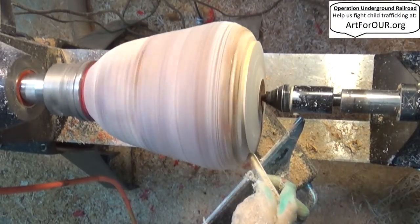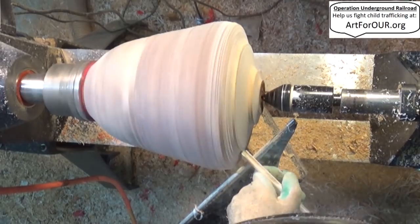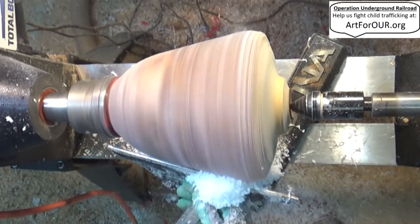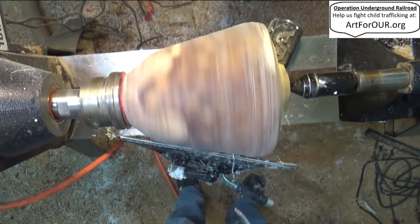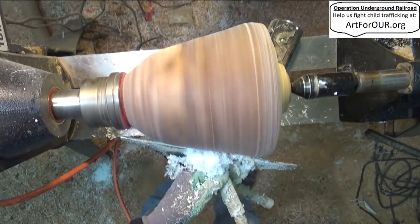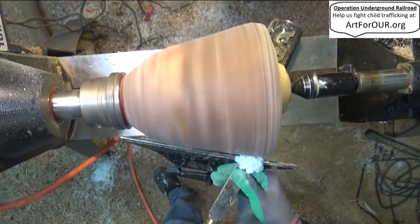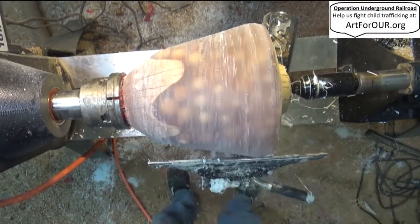Some people ask why I use gloves when I turn, which typically is a dangerous thing to do with rotating power equipment. With resin, when you're doing big projects, unless you've got all day to turn it and make nice little ribbons, you end up going through kind of a chip phase. I think Kim Tippin called it that, where you kind of just chip away at it and get down to where you need to. And with these big projects, you get some pretty big chunks coming off there, and I've had it destroy my skin on my hands and create wounds.